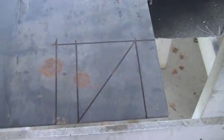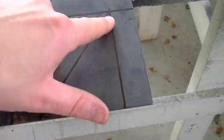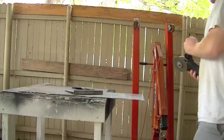You can see here I've got my gussets marked out. I'm going to cut along this line. This is going to be a flange — it's going to be bent at least 90 degrees, or a little bit more, for the back. This is the flange for the front — or vice versa, it doesn't matter, they're identical pieces. So I'll get this cut and then we'll put them in the press brake.